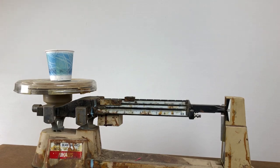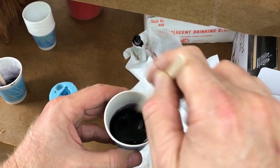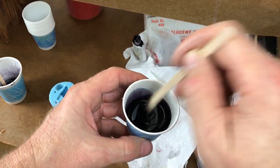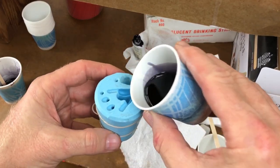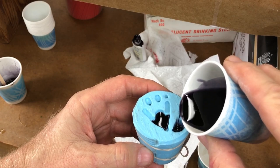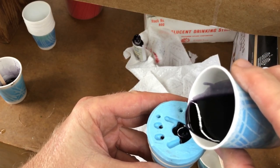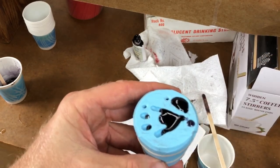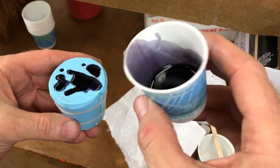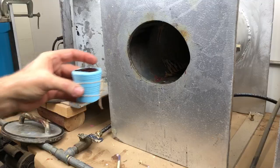There just isn't that much dye in here. Now we stir the resin and we go quick. It's pretty chilly in the studio today, so I can take a little more time. If it was really hot in here, this stuff would kick fast — temperature makes a huge difference when you're working with rubber and resins. Warmer material temperature means faster cure. So let's pour this in. You know they're full when you see the resin come rising up out of the vents. It's going down the sprues, already rising up out of those paws — and it's about to come rising up out of that vent. The resin has risen up out of all the vents. 30 grams is very generous — I have a lot left over. On the first shot I overestimate; next shot I'll weigh the parts and know exactly how much to mix. Into the tank it goes.